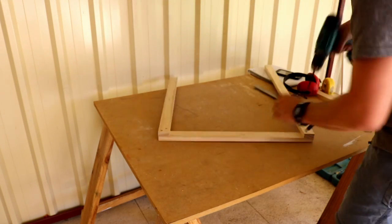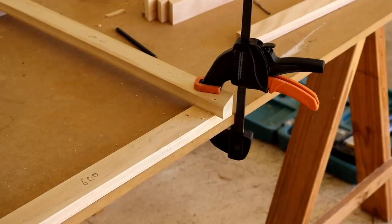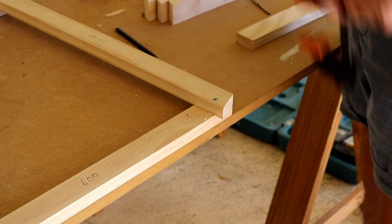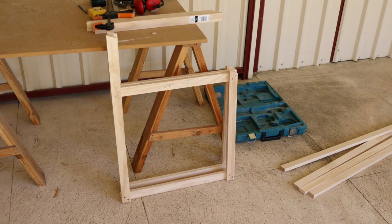When I was screwing the two pieces together, it really helped having some clamps there to hold them together. I'm specifically trying to sink the screws a little bit below the surface of the wood so I can cover them up with plaster later on. And there you can see what I mean about sinking the screws in — those are the frames I ended up with, so you can see the 20-degree slope between the two pieces.